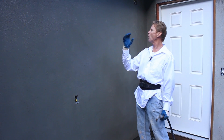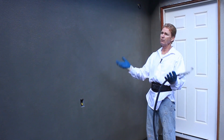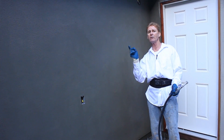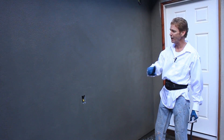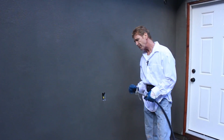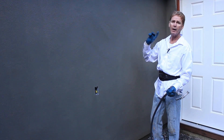What's going to happen is the water is going to absorb into this wall quickly in some areas. If you're in the hot sun, say you're doing a whole house color coat, you want to hose the whole house down. I'll generally start with the area where I'm going to apply the color first. The sun plays a factor too. It hasn't been long, but you'll see it starts to dry out — the top and the corner are starting to dry out. If I were to just take a color coat and start putting it on here, it's not really ready at this stage.